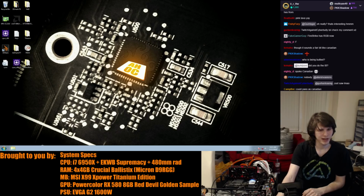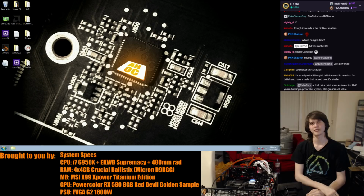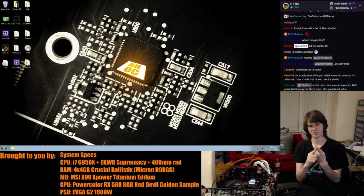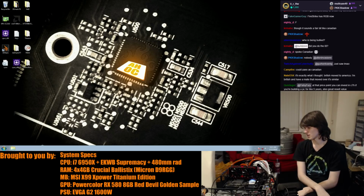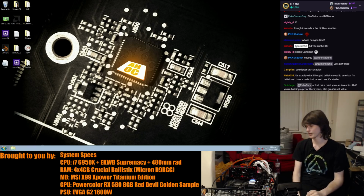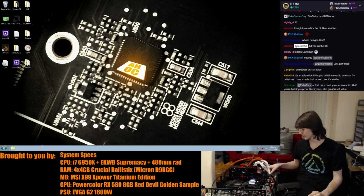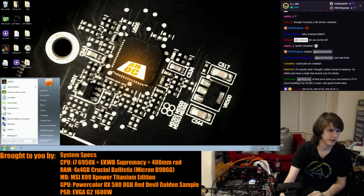Anyway, so this is artifacting again. Honestly, the most I can see this spitting out is like 18.3K at completely unreasonable core voltage and just generally unrunnable settings. So what I'm gonna do is restart, and we're going to build a final BIOS for the card, and I'm going to call it a day. So, not reset button, we're just going to restart.